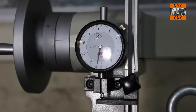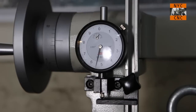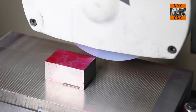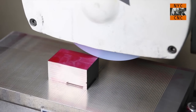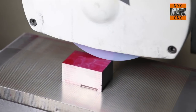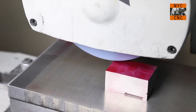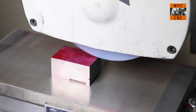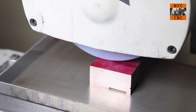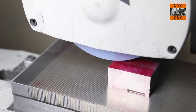And then let's come down. We're going to come down to 1/10,000th of an inch, just like so. Okay, no Dykem, no sparks. Actually, I can just see it's barely interfering with the Dykem. You can see it on the left side, a little bit.